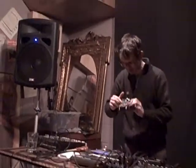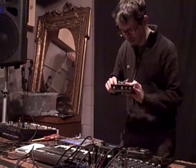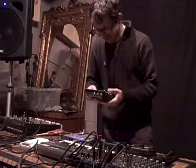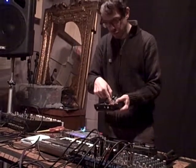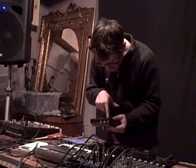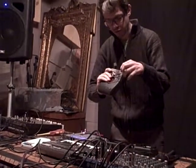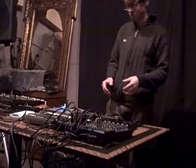There's a RAM chip inside of that thing. This thing is basically the processor for the effects. It's their own Zoom special DSP chip. But all the data that gets processed gets stored in a RAM chip. And this is what I'm bending. This is what I'm basically connecting cables to, all the tiny pins here, and I solder cables to them, attach them to those switches on the front, and then I'm able to do lots of really interesting sounds with it.